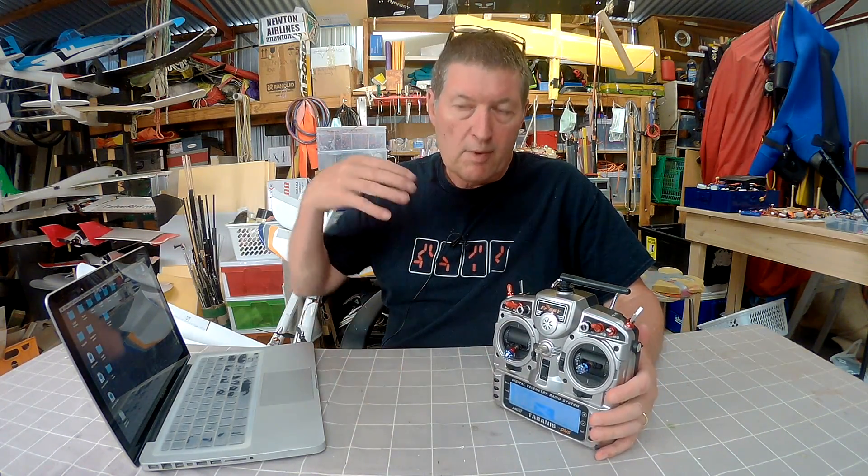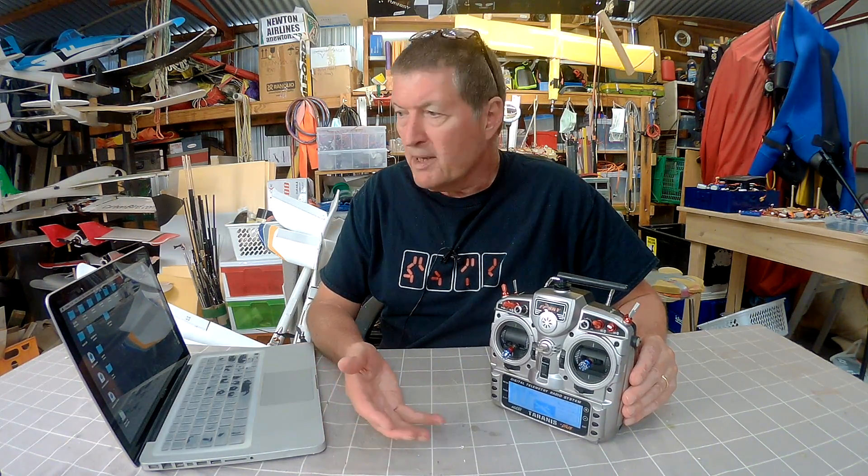The Bix3 has the on-screen display and is more for cruising around when I want to know distance, altitude, speed, and things like that — more for pushing the limits of FPV. The most important feature of iNav is the return to home feature, and return to home on a failsafe situation, so if you're running out of range your plane will automatically come back home. Another good feature is altitude hold, loiter mode or position hold, and manual or pass-through mode — all essential GPS modes.